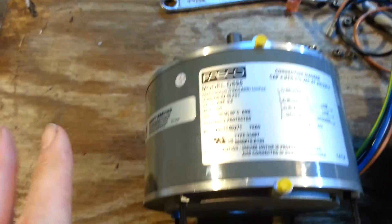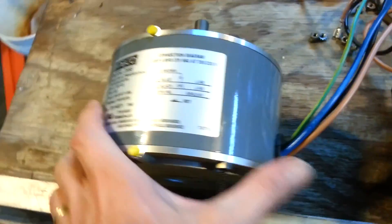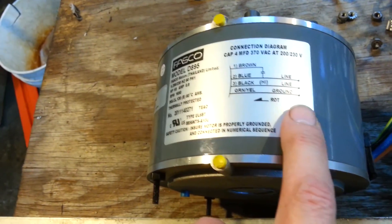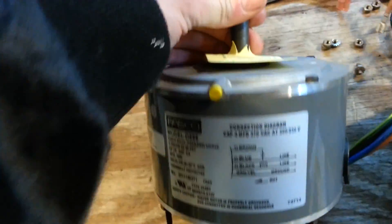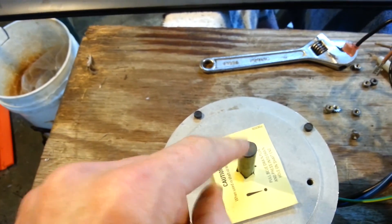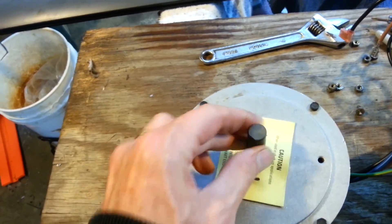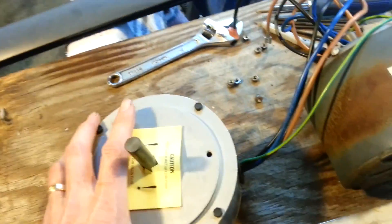I got the RPM and it's got the same rotation. When you're looking at these motors, you see it says rotation — it shows a little arrow going around the housing. To determine rotation, it's always talking about as you look at the shaft — the rotating shaft. This is a clockwise rotating motor. Some are counterclockwise. Some universal motors have all kinds of different wires where, depending on how you wire it up, you can make it clockwise, counterclockwise, one speed, two speed, or all kinds of configurations.